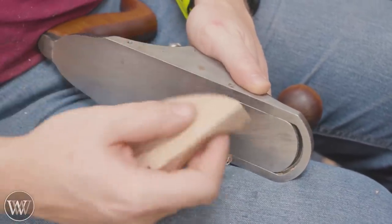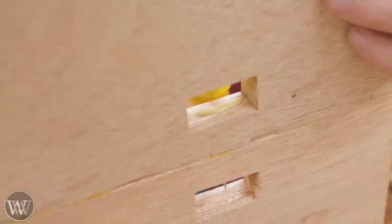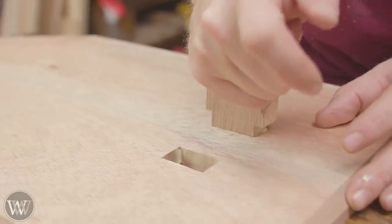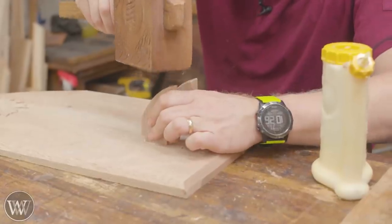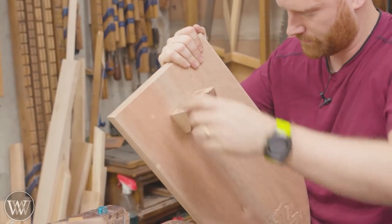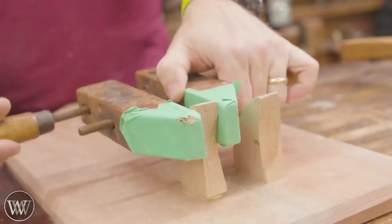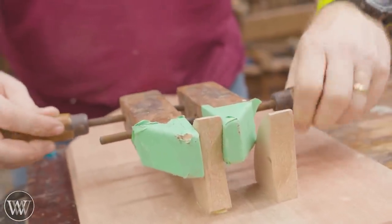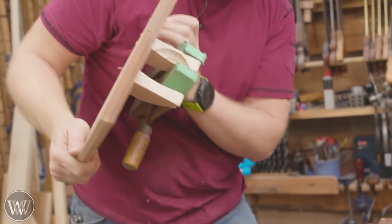For the holders, before putting them on I'm just doing a little bit of detail work — sometimes it's easier to take the piece to the tool when the piece is smaller. Add a little bit of glue, pound them in place, and let the glue set. We're basically ready for finish. If a little bit of glue smears out you can use the straw trick to clean that up from the outside, or hit it with a little bit of water since PVA is water-affected. I left these tight on purpose because I can't clamp them down — you want to make sure they are in there good and tight. Pound them down into place all the way. I had a little bit of issue with tapping one side rather than the other. I found that if you clamp onto it you can actually pound on the clamp, or flip it around and pound on the back of the board — that worked very well to get them down nice and tight.